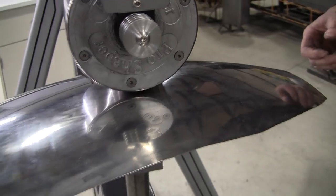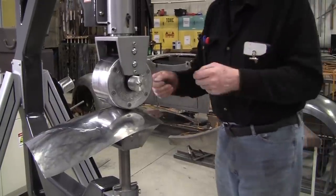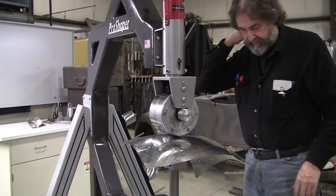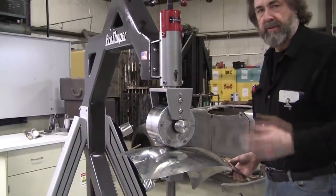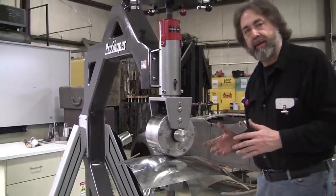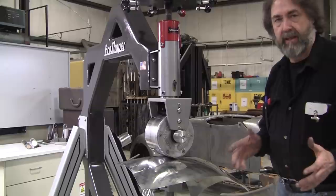And the parameters of each zone: it's really, really light on the low pressure side. That's where you barely even turn in the wheels. And you can use that for pulling down and changing, putting a radius in and stuff. And then when you go into the medium pressure zone, you're adding area and consistently adding area. If you're in the light part of the medium pressure zone, you're not adding area fast. But if you go into the heavy medium pressure zone, you are adding area at a little better rate. And you'll generally yield a really nice surface in that medium pressure zone.